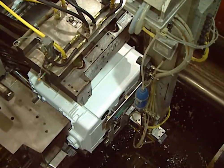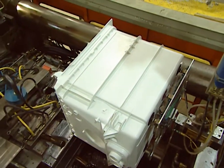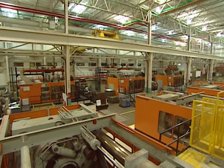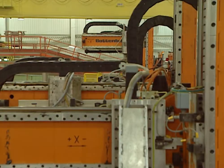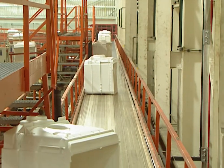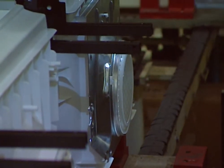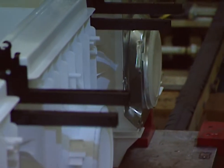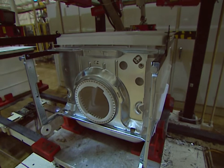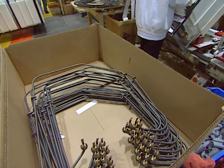In the same factory, using a different process, Whirlpool is making tubs for another line of dishwashers. But these tubs aren't stainless steel — they're made from molded plastic. Six giant presses using high pressure and high heat melt little polypropylene pellets and extrude the molten plastic to form seamless washer tubs. Robotic arms screw metal collars onto the tubs, and in an automated process, other components are attached and bolted on by machines. A laser then tests for proper assembly at nine different places in about three seconds.